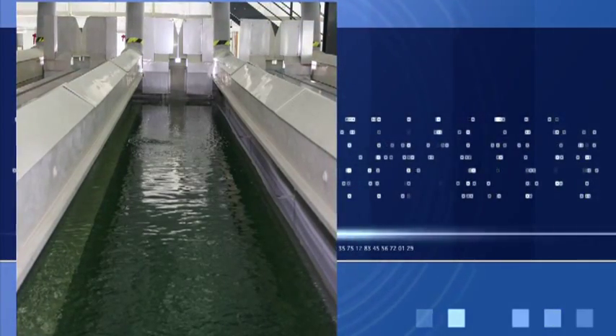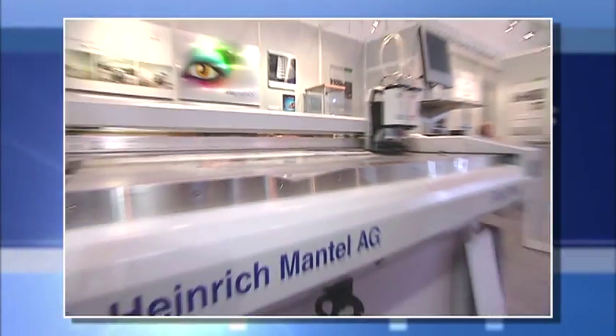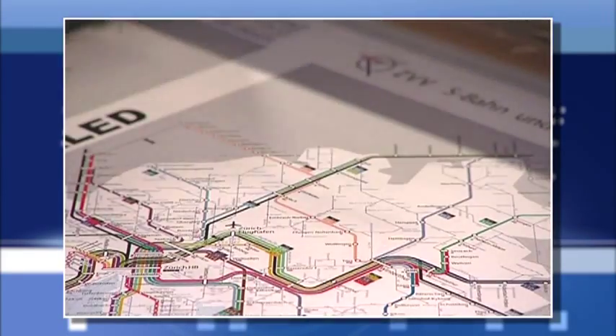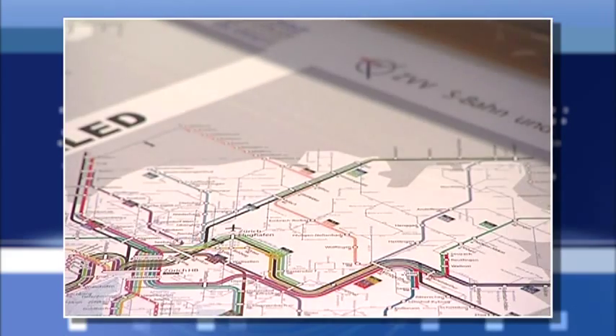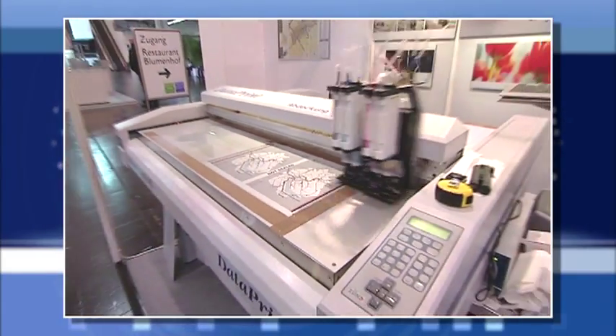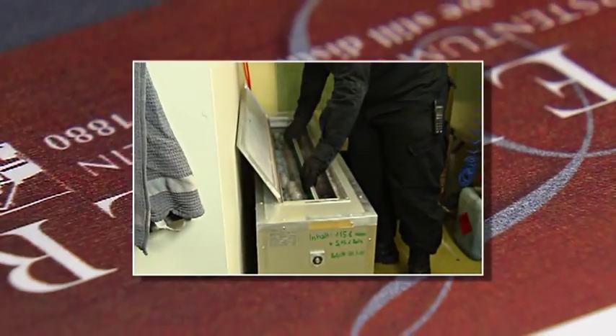The principle? Aluminum is anodized, using an electrochemical process that opens up the pores. State-of-the-art Primo Dyes four-color digital printers then apply several layers of ink. Any image can be printed directly into the metal surface in this way. The sign is then immersed in a bath of hot water, which seals the pores caused by the anodizing process and locks the ink in the metal.